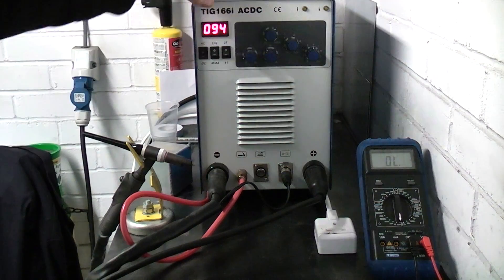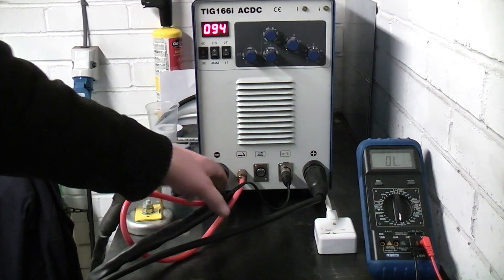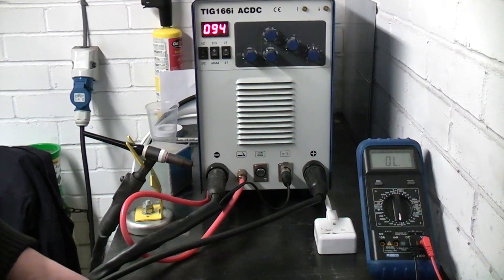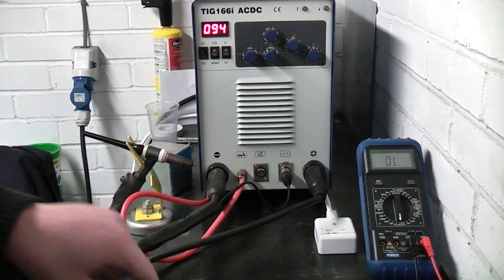There's no connection to the mains earth whatsoever. Now let's say this is a setup for TIG welding — so your TIG torch is negative and your work is positive. For TIG welding you have it that way round because more heat is generated on the positive side of an electrical arc, so you want the heat to go onto your work piece.